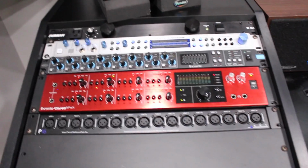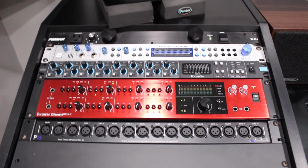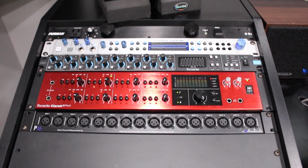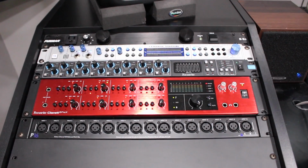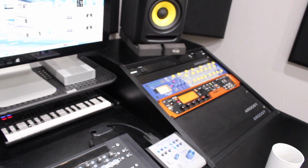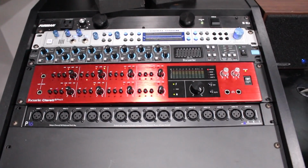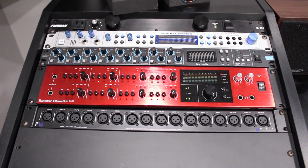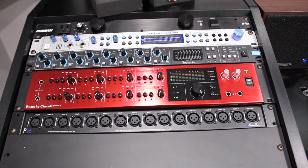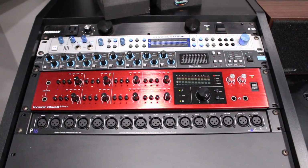So there's a lot of reasons why I bought this. It's 8 mic pre's with the air switch, which changes the circuitry inside the analog preamp, and it sort of has the air preamp, which mimics the ISA preamp. It sort of mimics the blue guy over there. It adds some nice, beautiful top end. It's nice to have basically two different sounding preamps in one box for all 8 inputs. So it sounds great, more headroom on the converters than the previous model.